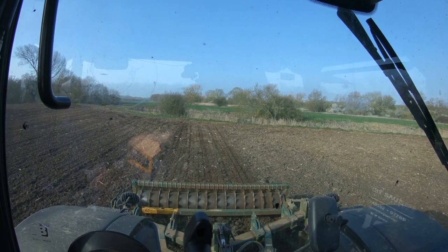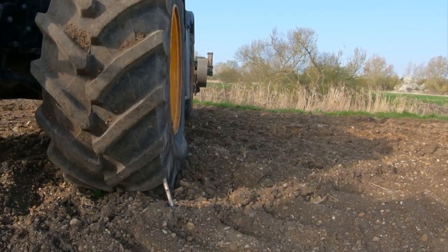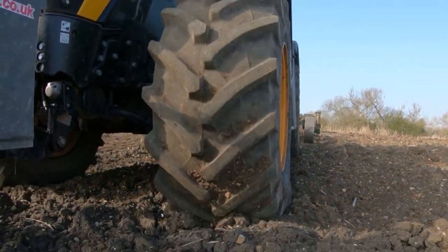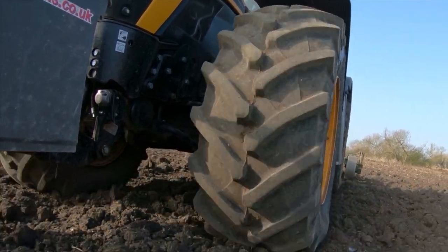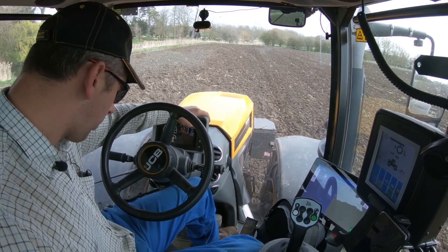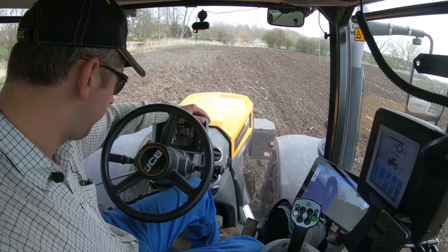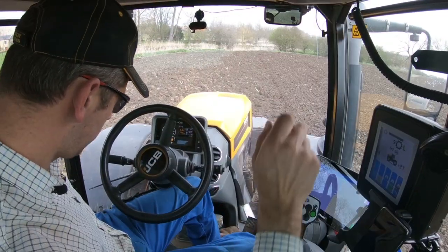There you go, we're cooking with gas now. Have a look. Lovely job. Well, we're getting on quite nicely. Old Fastrac's purring along. We're doing about 25 to 28 litres an hour. Forward speed is 4.6 miles an hour. We're about 1800 revs, so we're jingling. Jingling noisily.